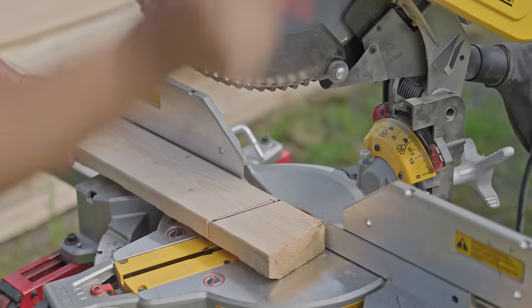And if I cut that with that same 18 degrees, okay, then I can add a fascia board across the front. So if I can put a 1x5 on there, then my fascia will actually hang below here, my siding will come up underneath it, and I don't have to do any soffit work. Remember, the way we're building this roof is not to let fresh air in, so we don't need soffits. So you have an aesthetic choice.